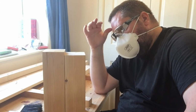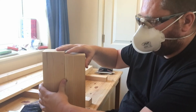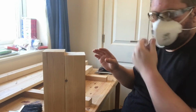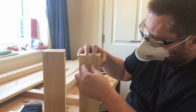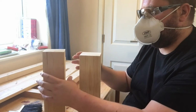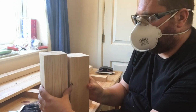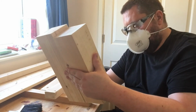Now, with it being a carving project, it's going to be worked on quite a bit by hand, and if I just glue them together, it might stick, but also it might come apart. So what I'm actually considering doing is basically do a couple of dowel holes, stick the dowels in, put dowel holes in here as well, and then glue all of that, glue the dowels as well, glue all the face, connect them together, clamp them together, and let them dry.